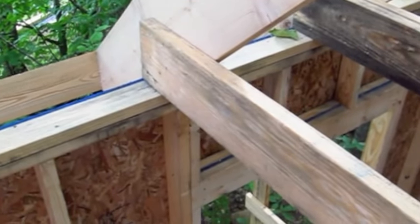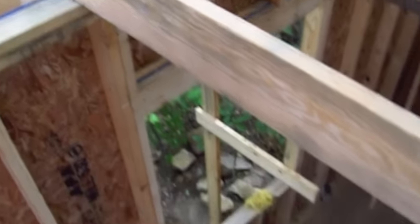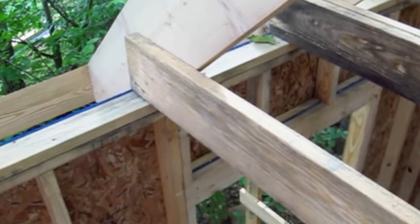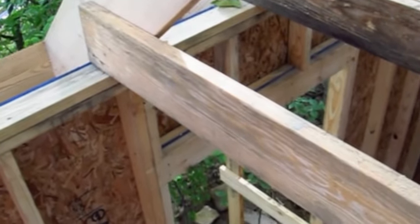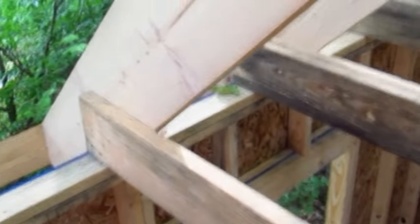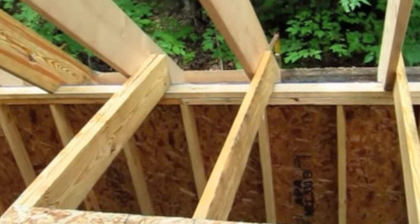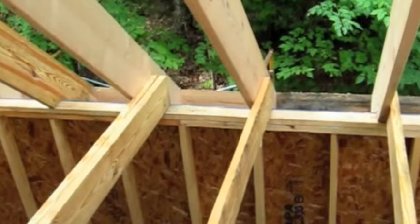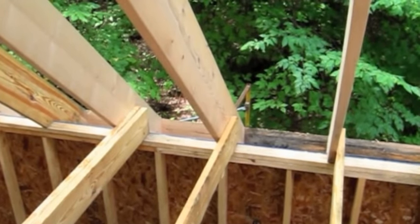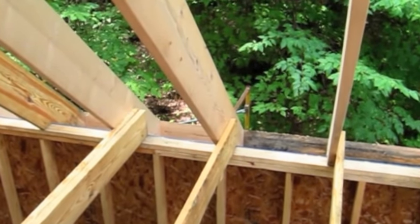You might call it the attic floor joist, or you might call it the ceiling joist if you were down below in this room because you're looking up. So it's really like three things, but it's a primary structural element for this roof so that we don't pull apart and we don't collapse the walls. It actually becomes the bottom of a triangle — this collar tie passes underneath the floor right here, comes out and connects to the bottom of the rafter. It's basically the third leg of the triangle, and if you remember from your high school geometry class or trig or physics, triangles are really, really strong structural elements.